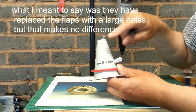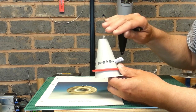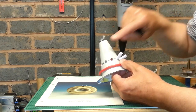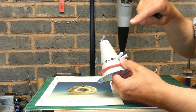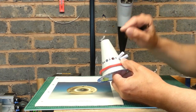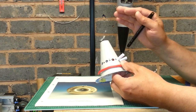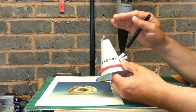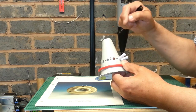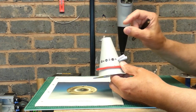Another thing is what they've done on the outside, which again I don't think is a problem. With the flaps on the outside you can fine-tune it by altering the flap sizes. They are open two and a half millimeters — check with the drill flat down on the flap, just catching the inside at the angle the flap sits at. That's the 2.5mm standard. You might have to fine-tune that a bit, perhaps in 0.1mm increments.